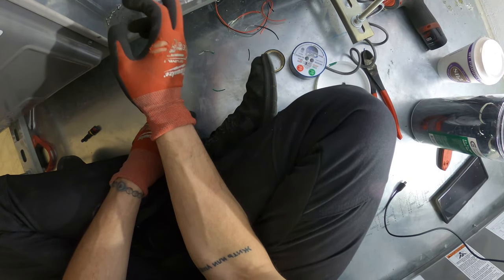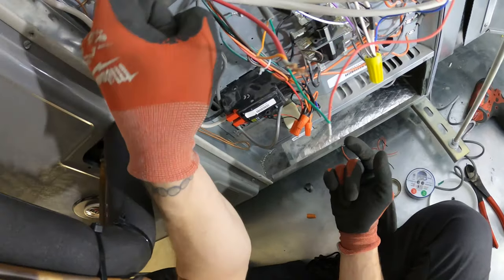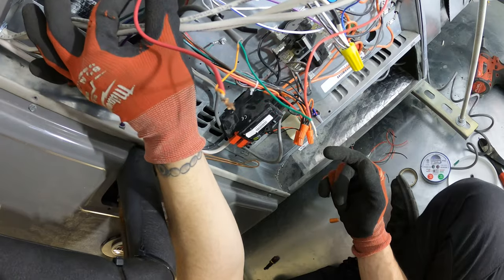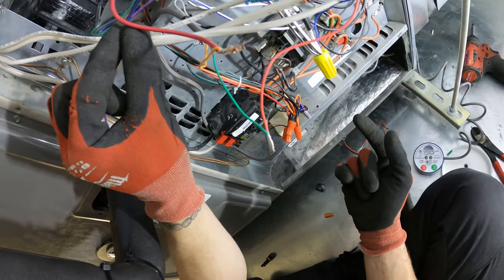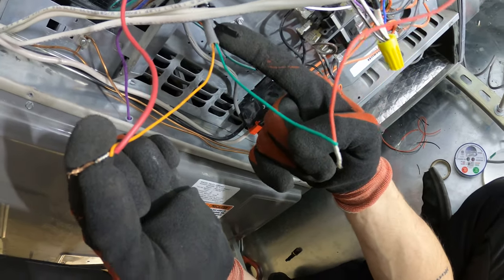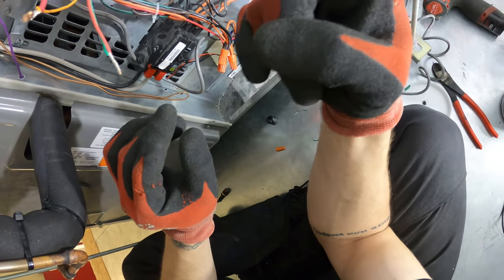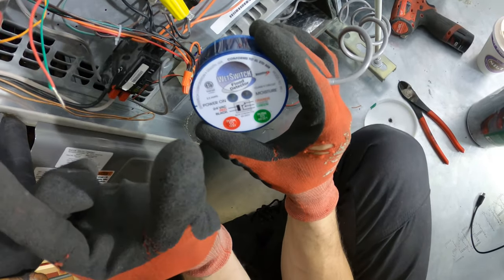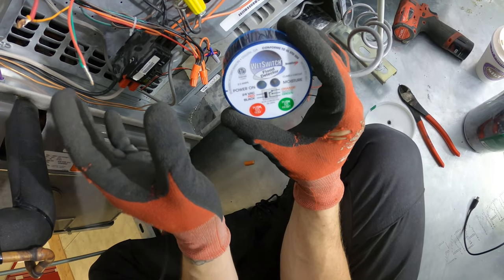So this transformer is actually what feeds power to the thermostat. So power is coming out of this board. So 24 volts is being sent out of this unit and actually feeds the thermostat. So 24 volts is coming out through here, but now it's gonna go into the wet switch and then out of the wet switch and then feed the thermostat. So if this senses water, it's gonna open our R, and by doing that, we're gonna kill the 24 volts